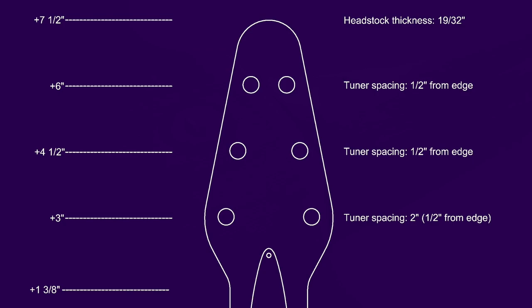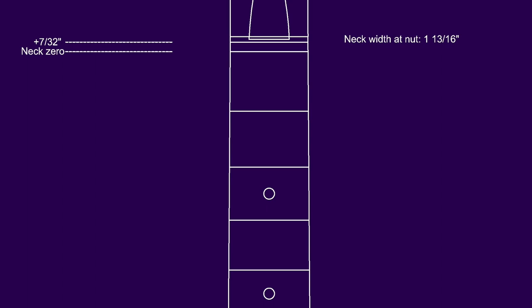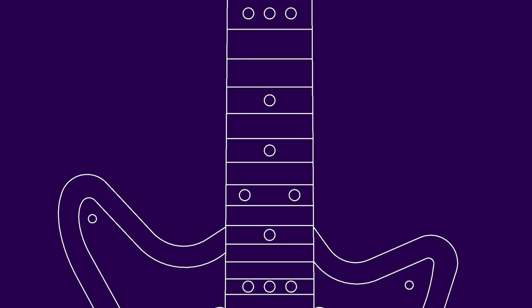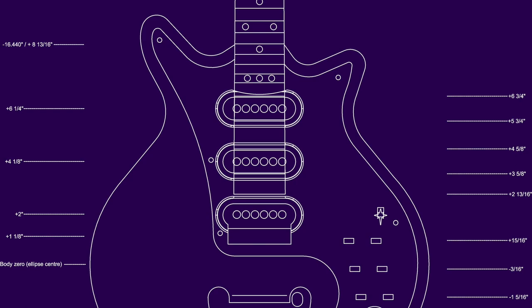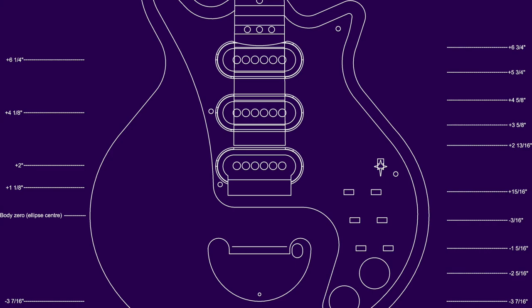It's good practice to create accurate design sketches, whether you're making a guitar neck using manual techniques, including hand-operated power tools, or by CNC as I did. If you're working primarily by hand, these will become your working drawings and underpin the design of any jigs and templates you require, including profile gauges. Brian and Harold May created their working drawings on sheets of foolscap paper taped together using traditional drafting methods and implements of the mid-20th century, including pencils, rulers, compasses, and French curves. I've illustrated this process in another YouTube video entitled How Brian May Designed His Red Special Guitar.